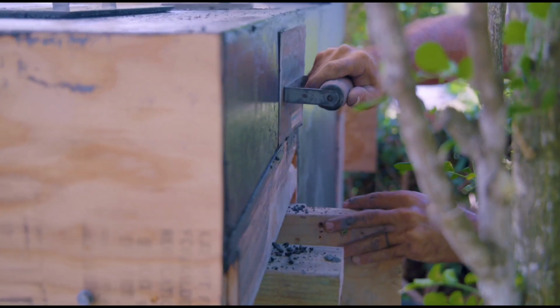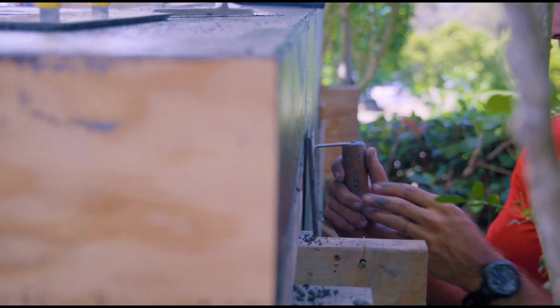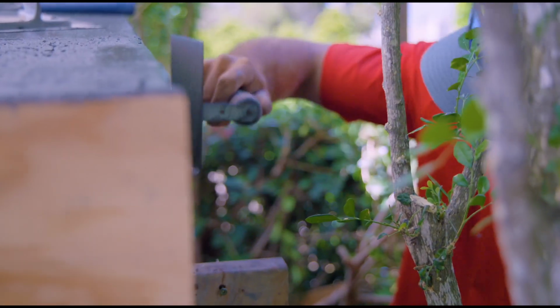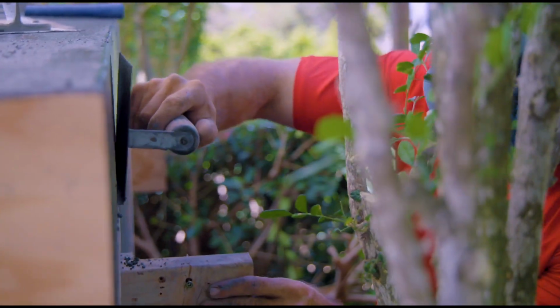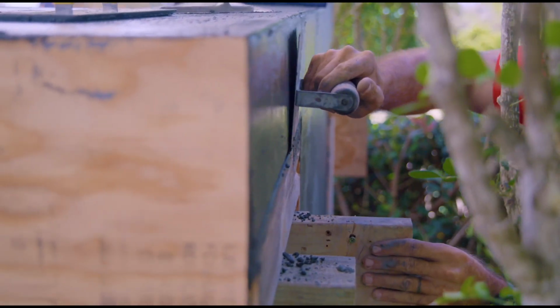First couple passes with the edger is just to really open it up, like I mentioned before. Get the radius in, move all the aggregate that's in the way on those forms. After that, as you bring up more cream, you can push in cream, or we can use our slurry that we made in a bucket to close everything up and make the edges really nice.